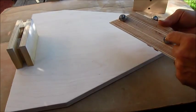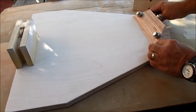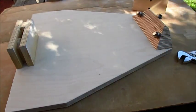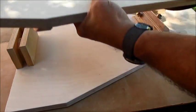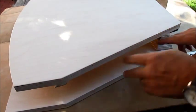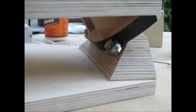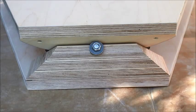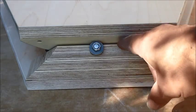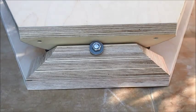You want to be sure that you drill perpendicular to the faces so that the studs are perpendicular. This goes on here — let's put our platform on. With this in place I took my one spacer out and this should fit nicely like so, still with the same three-inch spacing. Here's what it looks like from underneath — here's the bearing block from the back side. You need to have the bearing stand off a little bit to form a small gap just for clearance. That looks pretty good so I'm going to go ahead and glue the block in place.